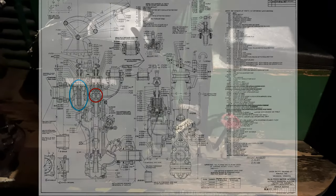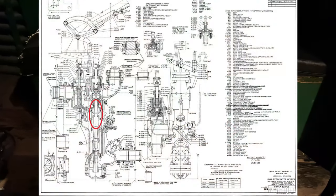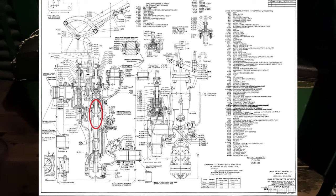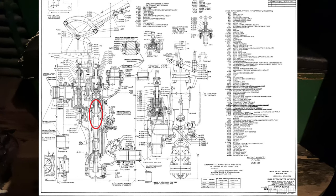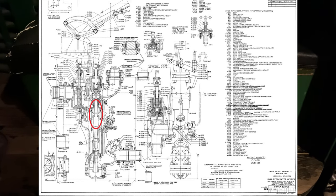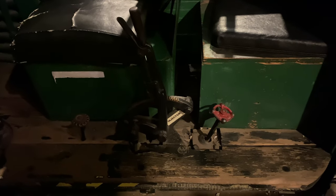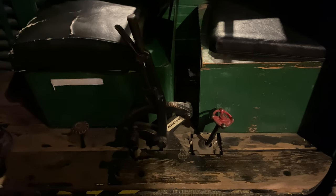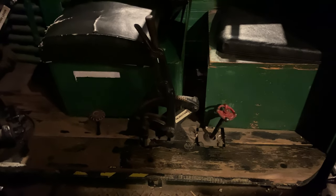And when that happens, the steam enters in through the steam nozzle, which starts off small and expands into a wider diameter. What that does is that brings the pressure of the steam down from boiler pressure to basically atmospheric pressure. But in that process, that converts the pressure into velocity. So now the steam has gone from high pressure, low velocity, to low pressure, high velocity. And that high velocity, low pressure steam now hits the water and travels through the combining cone.